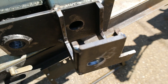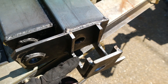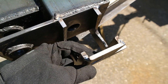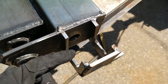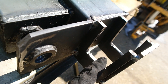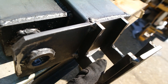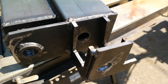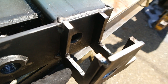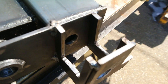Here's a closer look at what I just welded. This is the bottom mount for the hydraulic cylinder that's going to control the slew rotation of the backhoe. The hydraulic cylinder is going to go into here — this hole is going to receive a one inch pin. These are the supports that support it, and these sections are cut out so there'll be clearance for the cylinder rod as this pivots around. I tacked it in, tested it for fit, and everything will work great. Now I'm going to weld these two pieces into final position and finish adding the brackets around it.